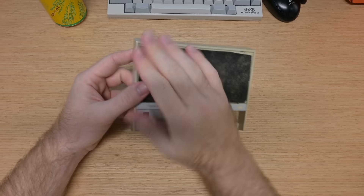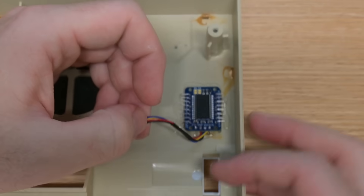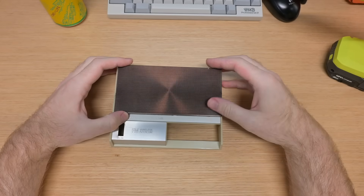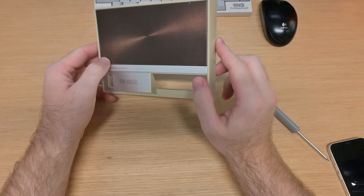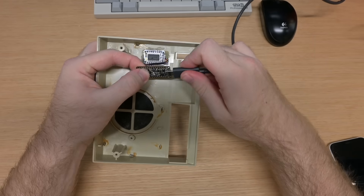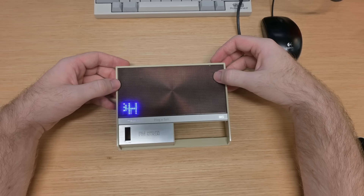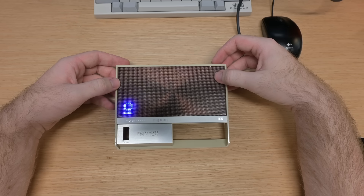At this point, we can make the incision into the case and we can install those LEDs. It's pretty easy to glue this LED matrix in place. Then we can cut the fabric that was previously there to muffle the tinniness of the metal grate. Then I can carefully rework the metal grate back onto the cover, and no one should be any the wiser that we had cut or changed anything. Once that's back on, I just grab an Arduino, hook up this LED matrix, and I'll just run the demo program and we'll see how it looks. Yeah, it's upside down, but it looks pretty frickin' sick. It's gonna be a really nice little flair on this whole project.